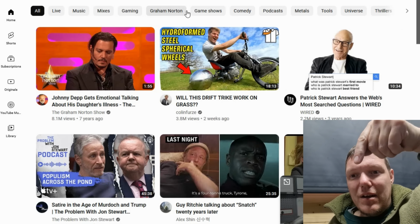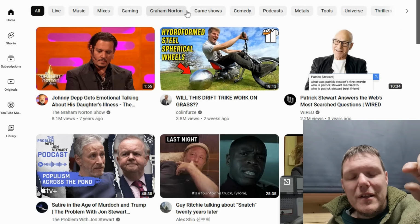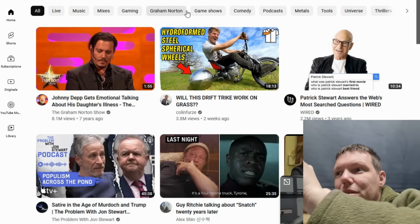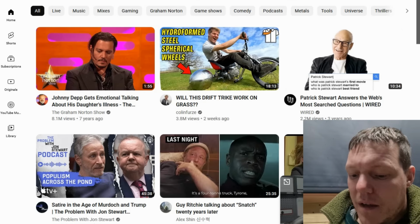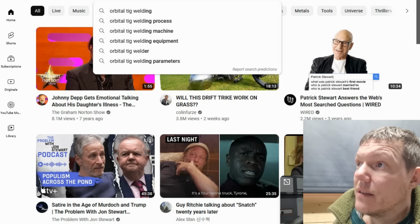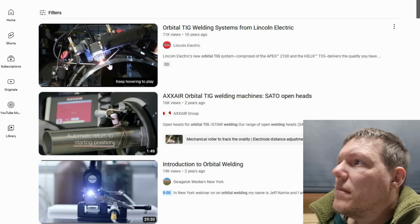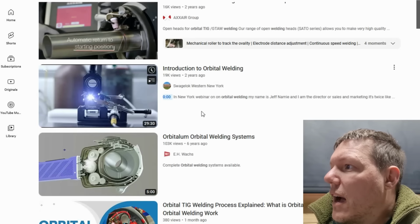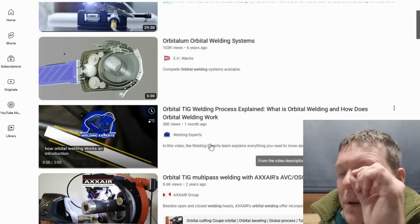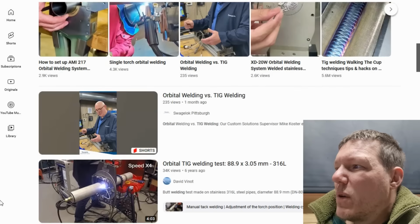Well, it usually only does it once. It has a start up, and it'll go right 360, and go a bit past, and trail off. So you see the little stack of dime type things go, and just fade off and disappear. Orbital TIG welding. I've used tiny ones like these for doing little tubing, like 5-10 mil tubing, a lot of Swagelok type stuff.